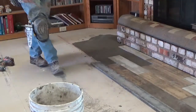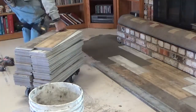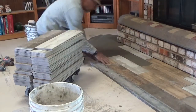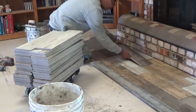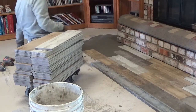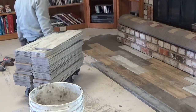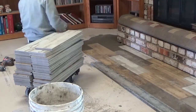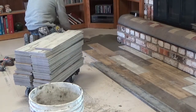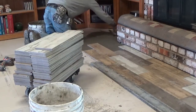As you can see in this video clip, what he's doing right now is continuing on that tile I showed you earlier — the big bulk that he had laid. He keeps them going straight to the wall, keeps them all in one direction, and lays them down one at a time following that chalk line. You can see next to the tile he has that long straight metal bar, and he keeps moving it down further and further until it's all the way against the wall — that's how he keeps them going straight.